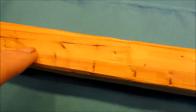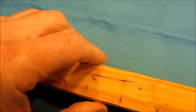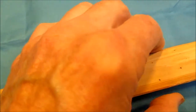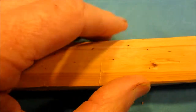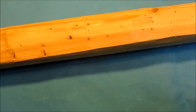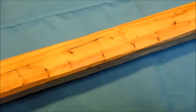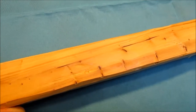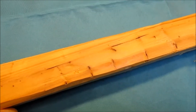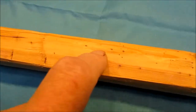It's that thing about following the grain of a bow sideways, along the length of it, from side to side, and also about chasing a ring on the back. Yes, you need to do that with some woods, like Osage specifically, and I think that's where most of it comes from, this idea, because there's a lot of input from America, and that's where they use an awful lot of Osage. But with yew, you can get away with a bit of wandering.